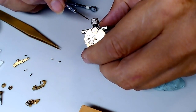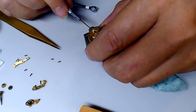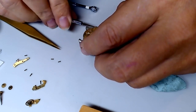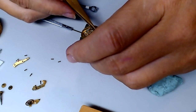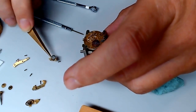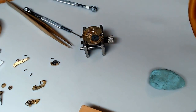You go 'ping' and then you're done. Just lift that up like so — it should come right up without a problem. It is lifting, being a bit of a pain but still lifting. Grab that as a unit, turn it around nice and easy, have a look at what that is — I see the way that goes in. Another photo, and then another, because photos are absolutely essential if you're doing any watch repair. Make sure you meticulously photograph everything as you remove it, especially when you don't understand a particular movement.